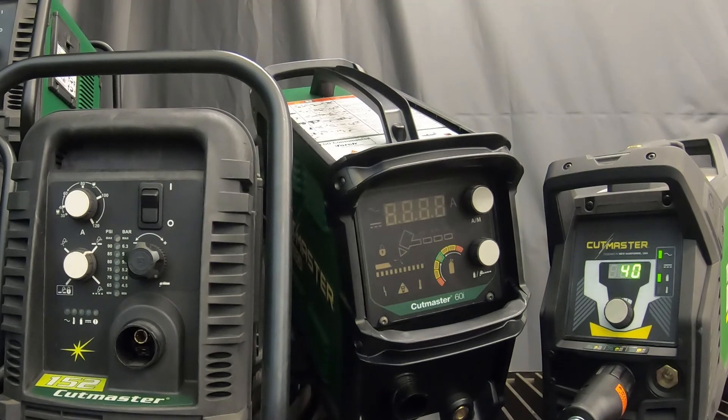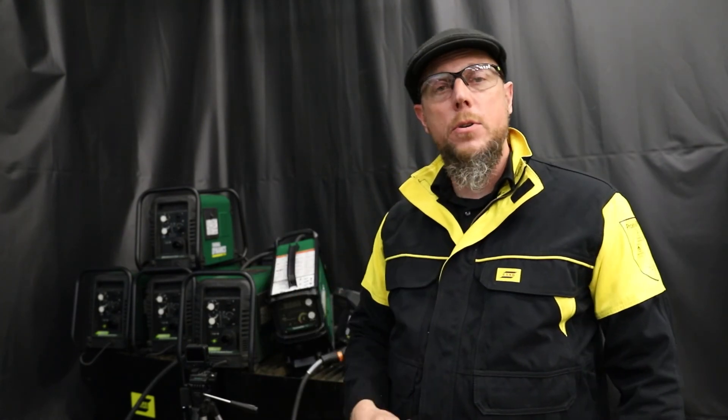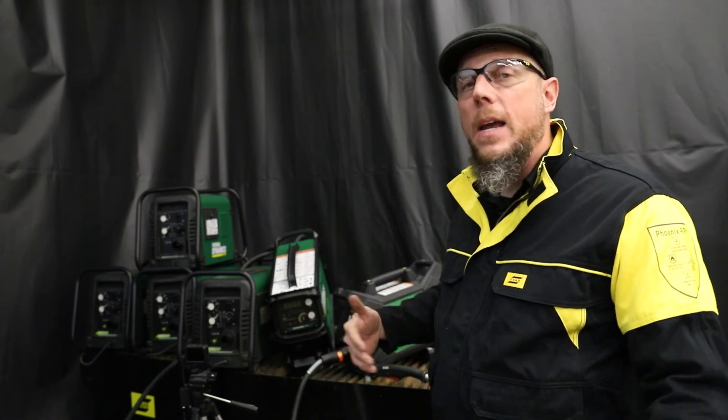At the end of the day, each of your plasma machines is trying to communicate with you — that's the whole point. You're going to check your air from tip to tail, from source to plasma. Make sure you've got 90 to 110 PSI. Make sure you don't have 500 feet of quarter-inch hose and wonder why you don't have the volume — make sure you have enough diameter of hose and enough pressure to provide the pressure and flow rate the system needs. Then on the power side, refer to your owner's manual, make sure you've got the right power connected. Once you do, step through those communication codes, work with the machine, and you'll be up and running again.